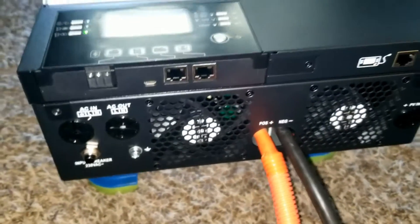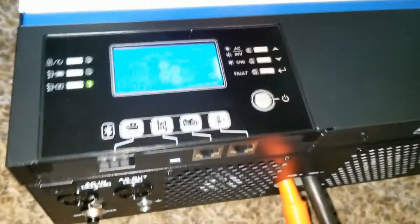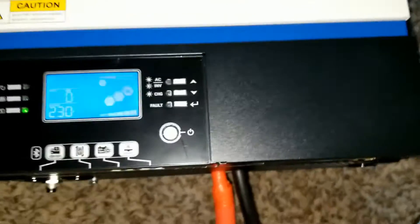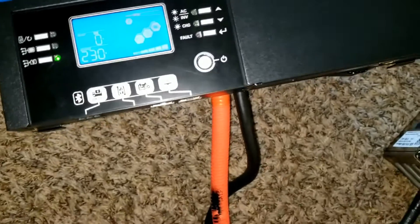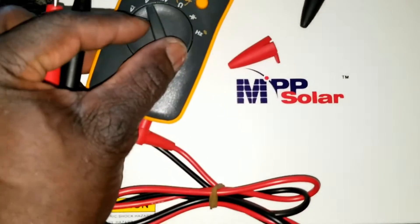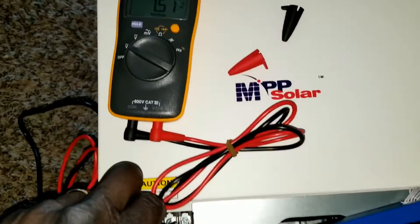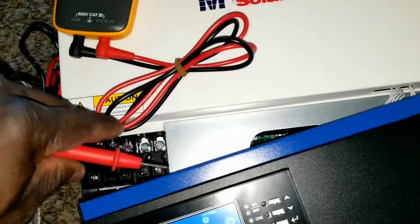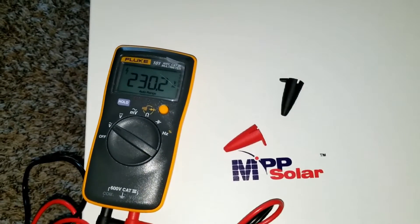So I think it's in the default mode that lets the fans run continuously, unless you put it in power saving mode by configuring it. So what we're going to do now — we have to test the power output. We're going to move this out a bit and get my probes. Right now without a load it's running continuously. We have to set this guy to the AC setting, and there — it's reading 230 volts. Woohoo!